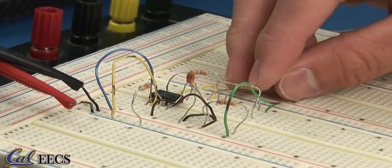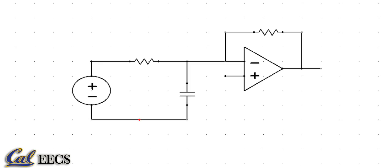Don't think about circuits in terms of wires and components. Instead, think of circuits in terms of nodes. Remember that the voltage at a node is always measured relative to the voltage at another node. There is no such thing as an absolute voltage. Generally, we choose a common reference node from which all other node voltages are found relative to, and call this ground. To make the math simpler, when we perform circuit analysis, we say the potential at ground is 0 volts.